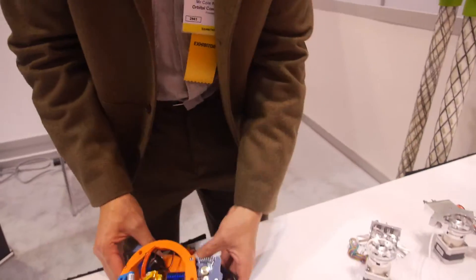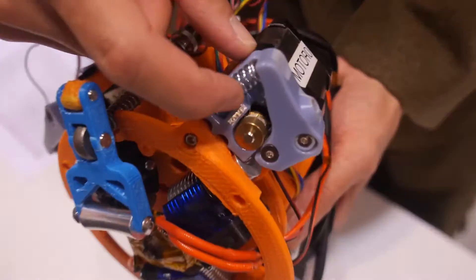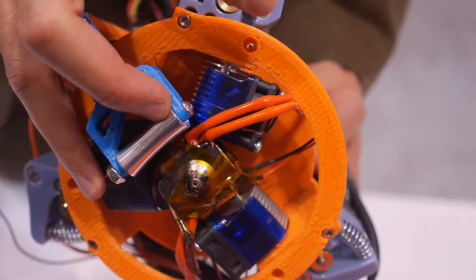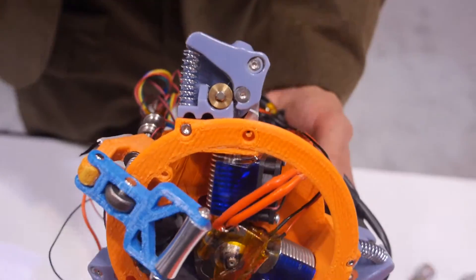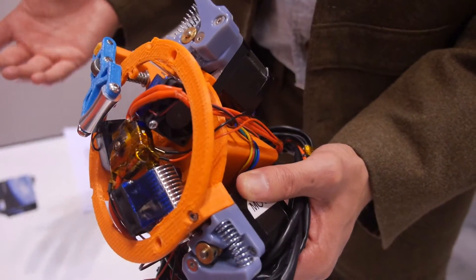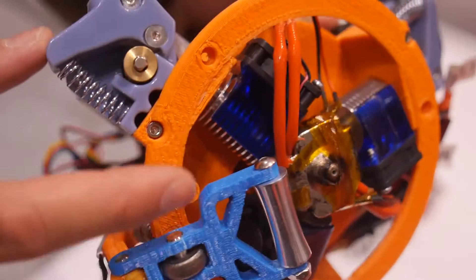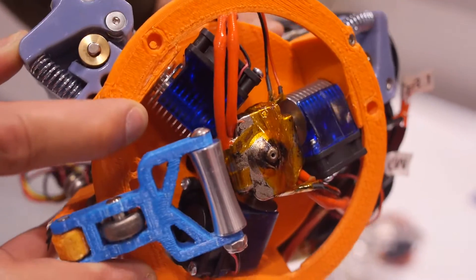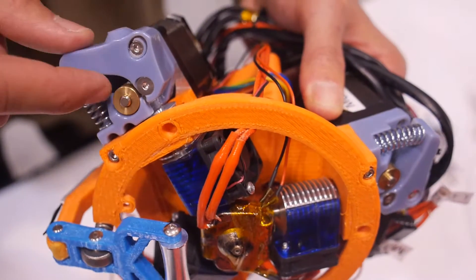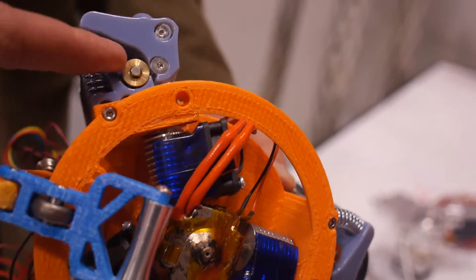This is a traditional filament driver mechanism. If you look inside, you can see there's plastic dust inside. You have a round driver mechanism, or hob, and then a round idler bearing on the other side. The filament goes through in a straight line. The problem is that the surface area point of contact between two round objects is zero, so the only thing driving the plastic are the small serrated teeth — and you're only able to use between one and three at a time. If there's too much back pressure, it strips the filament, the build stops, and the back pressure causes it to fail yet again.